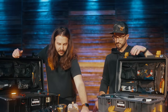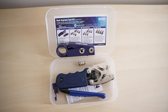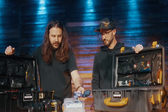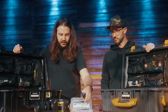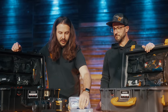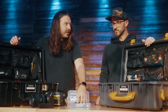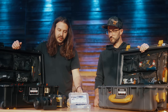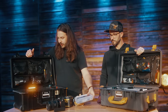I have a toolkit for terminating SDI — it cuts the cable, trims it back, and compresses it using compression ends. This toolkit is about $275. It's just been easier to come on-site and terminate the cables so people don't have to buy them pre-made. If you're doing your own SDI terminations a lot, this is the kit.